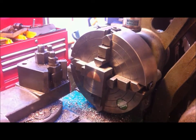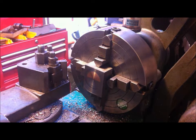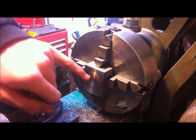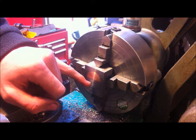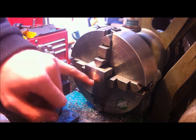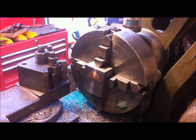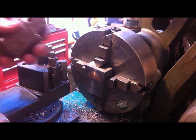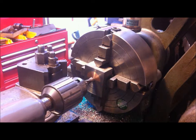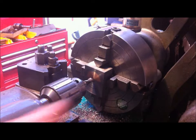If this was just one block of steel I would have centre-drilled and drilled up to as close as size as I could get to the finish diameter. But as I have two dissimilar metals here — bronze and steel — I'm worried that the drill or cutting tool will move sympathetically with the steel and cut more out of the bronze. So to reduce the effects, I'm going to start the hole with a series of slot drills, which should stay on track better than a twist drill would.